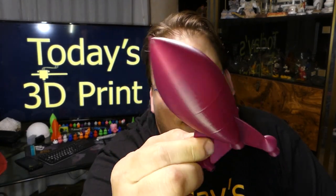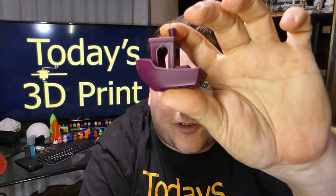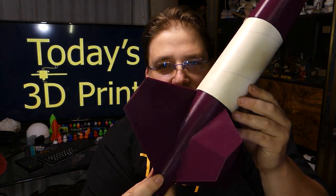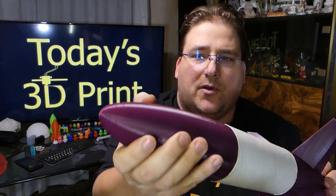Here is the rocket that I always print — fabulous. The little Marvin, very nice. And the Benchy — very, very nice Benchy. This filament is interesting because it changes color depending on what temperature you use. You get a matte finish when you print at 200 degrees, but if you print at a higher temperature you get a shiny finish. This one is printed at 225. I love that color. Beautiful, beautiful finish.